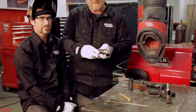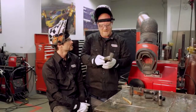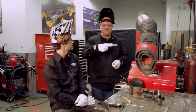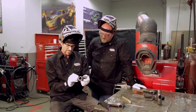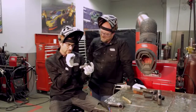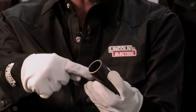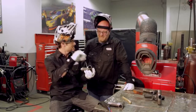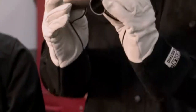With a little bit of practice on restarts, you can literally go all the way around and only have one start spot instead of a bunch, because each time we stop the weld we have to tie into that spot well to make a good weld. Another good tip is when people go to tack, they tack right in the middle of where they're going to put their weld. We've already added filler rod there, so the better thing to do is make your tack welds small and put them in a place where you know you're going to stop, so you can make nice continuous welds.